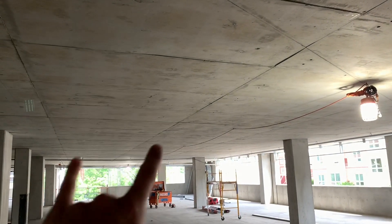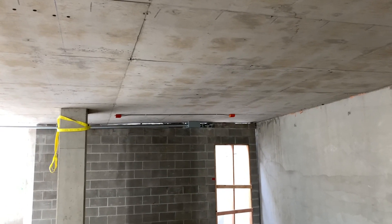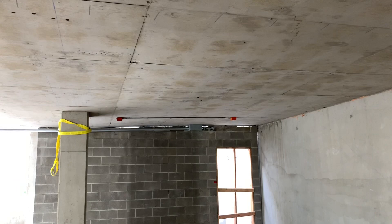We're going to finish this one to the other wall, and we do have to do another run over here — there's a mark right here for the last box that'll go on the ceiling, also running to the far wall. I have to set the laser up tomorrow for both runs, which takes about 10 minutes. It's better to have straight pipe than redo it later. The ceiling cracks aren't straight enough to use as a reference for exposed pipe, which is what caused my first run to be wavy and need to be torn down and restarted.